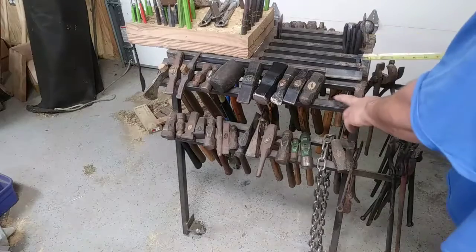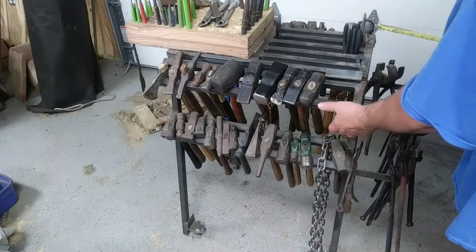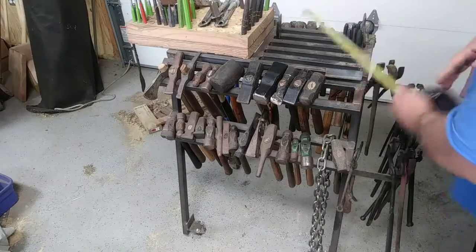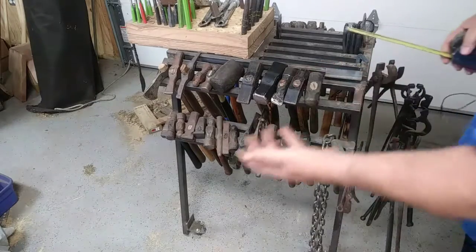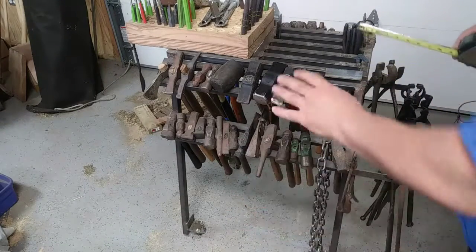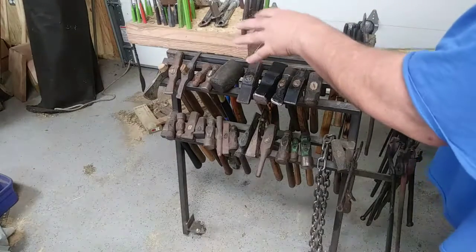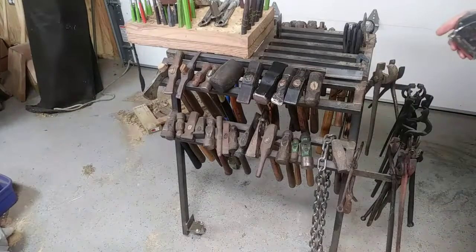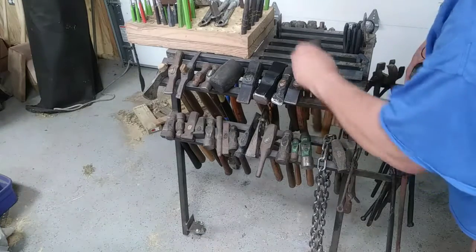When making this part, I cut eight pieces of one-inch square tubing 28 inches long — the whole thing is made from one-inch square tubing. I also cut eight pieces 25 inches long, the same length as the frame width. I put a two-inch gap in between for handles, though you may want to go smaller. I cut eight of these two-inch spacer pieces, laid one on my table, squared it up and tacked it, then laid each successive piece on top as a guide and tacked them all, then welded them all up.